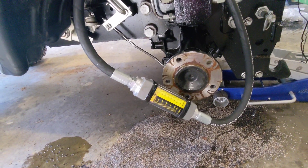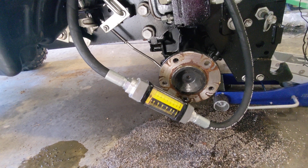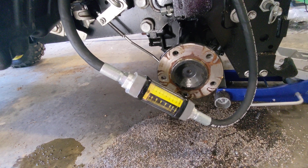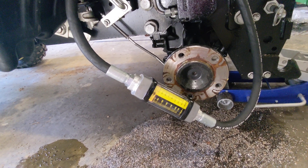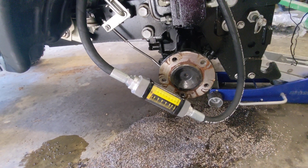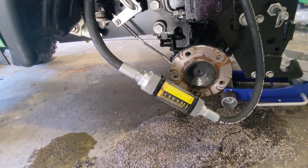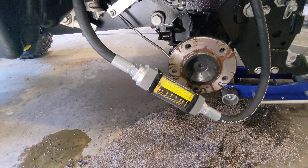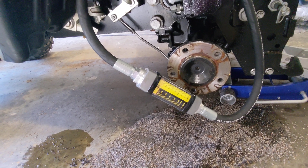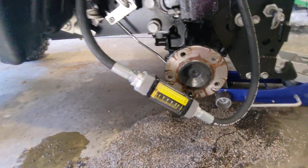What I can tell you is this is the nine gallon per minute pump. Ultimately it shows that the nine gallon per minute pump I've been talking about is actually outputting nine and a half gallons a minute. So nine and a half minus two — or if you want to go down to one and a half — you're looking at seven and a half to eight and a half gallons a minute to the implements. That'll run pretty much anything you can put on here. Compare that to a 2038R, which sends about 5.3 gallons a minute to their implements.